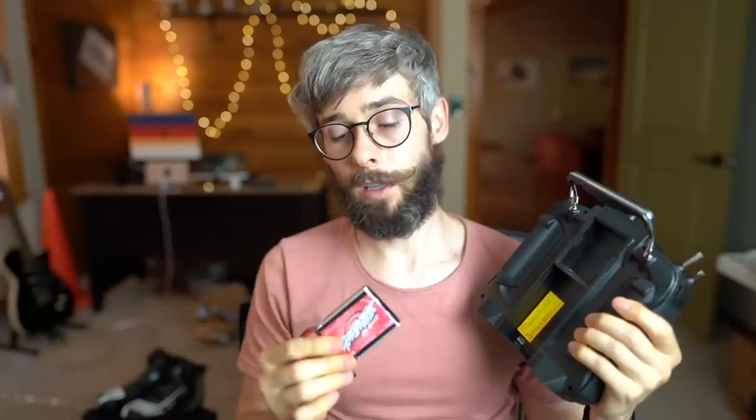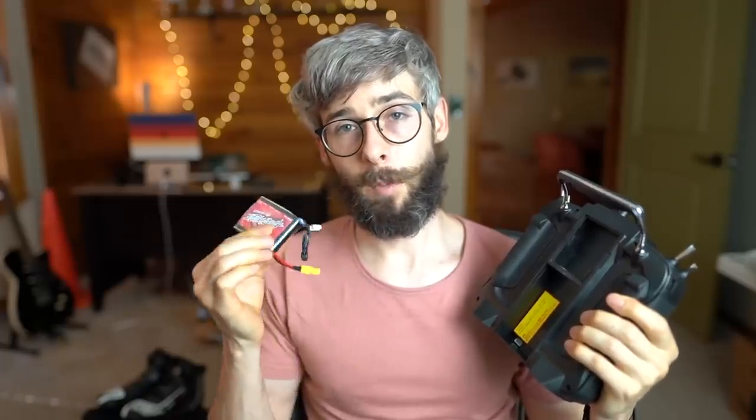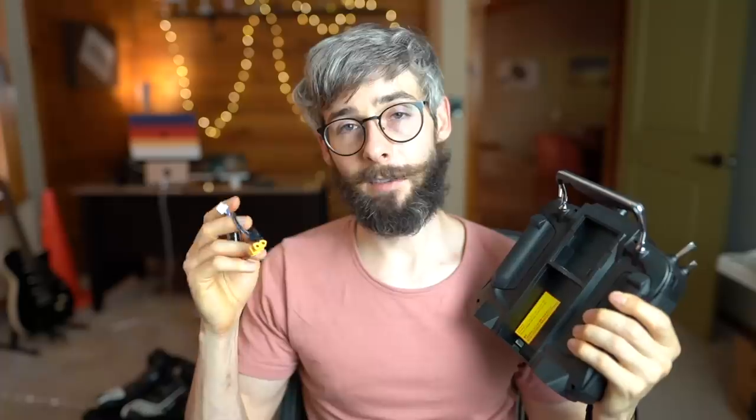The battery I have in here — this doesn't come with the battery, by the way — is an Adrenaline 2S from Thunder Power. It has a barrel connector and an XT60 on it for easy charging, and the balance connector is what actually goes in and powers the radio. This 2000 milliamp battery works really well. You could go higher in milliamperage for longer battery life, but it's a play between too much weight and too little weight. It seems adequate — I've been on the sim with this radio for hours at a time and it's not even drained halfway over multiple days.